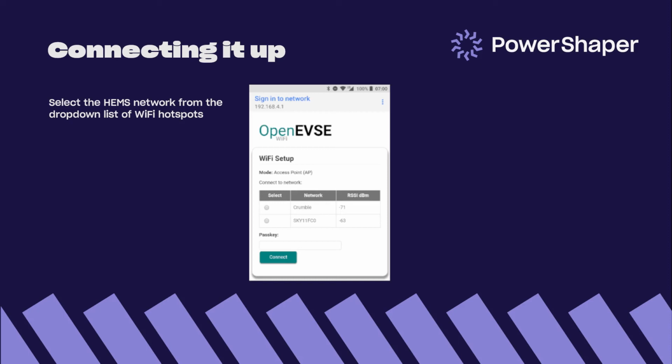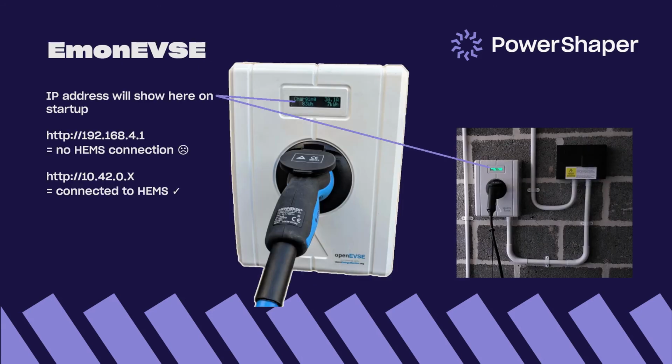And that will then give you an interface on the OpenEVSE, which shows you the list of Wi-Fi networks that it can see, and hopefully your HEMS will be in there. Well, that's the one that starts C Corp, HEMS, and then some numbers. If you can see it, select it, enter the password. Again, that's from the bottom of the HEMS, and hit save. The system will then reboot, and hopefully that will then connect to the network, and you will get a new IP address flashes up as the system restarts. It should start with 10.42.